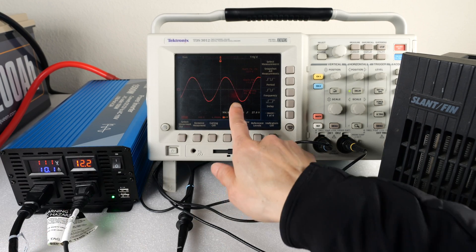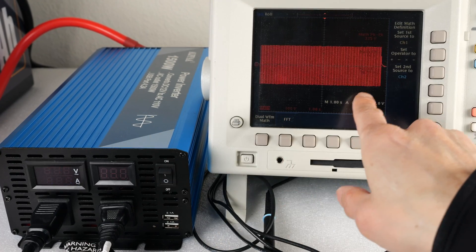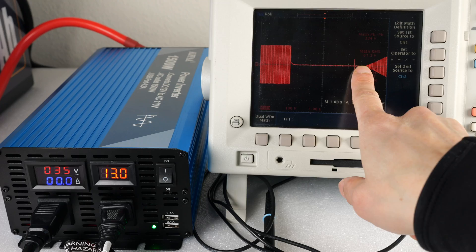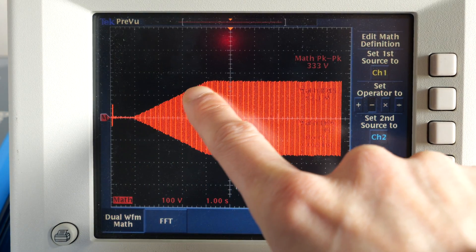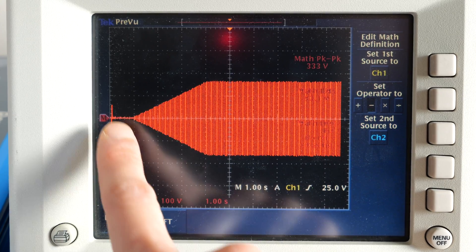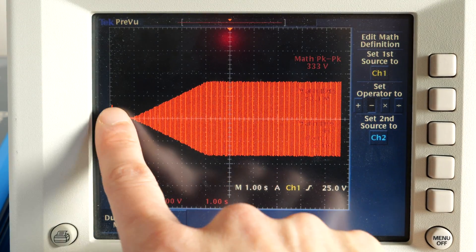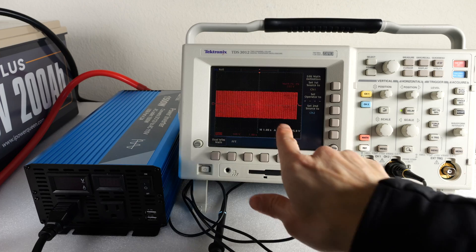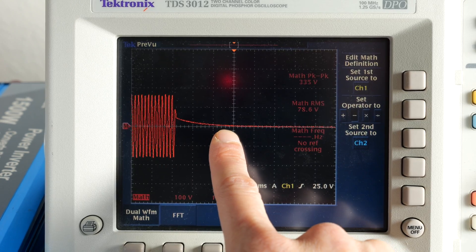It's running at 10 amps out of the AC. The waveform is fairly uniform. Look what happens when I turn it off — it goes to zero fairly quickly. But when I turn it back on, there's a blip, and over the period of about three seconds or so it slowly ramps up from zero volts to maximum voltage. So this not-quite-110-volt-RMS period would appear somewhat like a brownout, but it's a very quick one. It's not continuously running your stuff at reduced voltage, so this may or may not affect your sensitive electronics. If I don't have a load connected and then turn it off, the output tends to fade away rather than drop right to zero — not too big a problem, it's after three-tenths of a second.